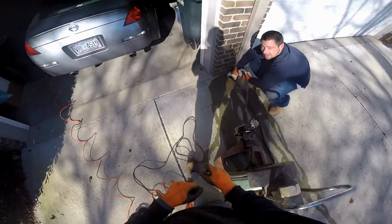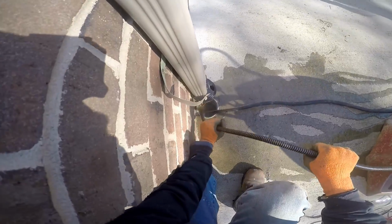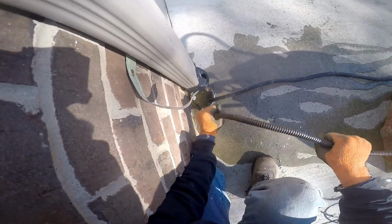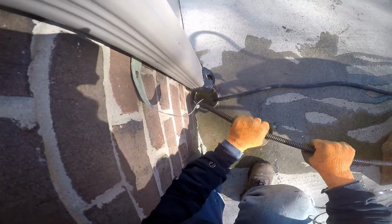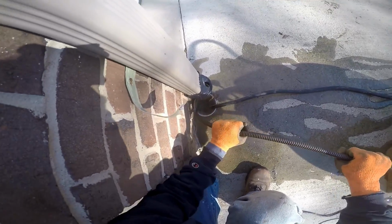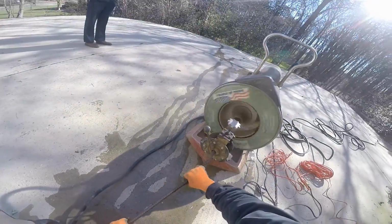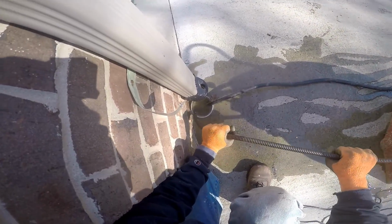First, I'll go ahead and push the cable a little bit more. You can see we're adding water to this downspout drain as we run the cable, and it's backing up again. Very important that we can get past this stoppage to make sure that this is going to be open. If we can't find it, hopefully we can get the line open and allow some relief until we can determine what we need to do here, which is probably replace this entire line. Can you hear how the machine is changing pitches? That's because the cable's binding up, and you can see I'm pushing on that cable, but it's not going anywhere. There's definitely a problem in this solid PVC drain that's not allowing that cable to go through. You can see that water's still backing up.